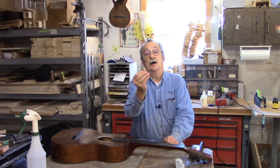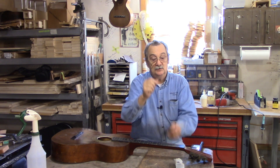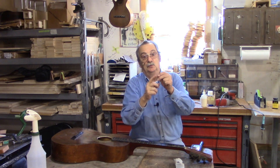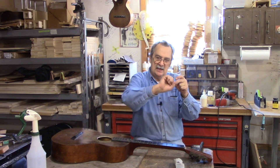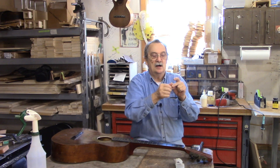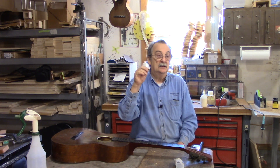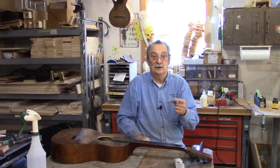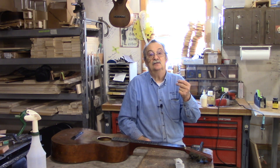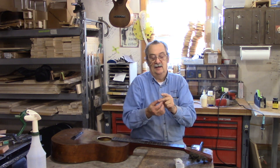One last thing — see that slot? That's not for a screwdriver; that goes in first. You want to put this in with a quarter-inch shoulder bolt. Run that in, kind of turn it sideways, go counterclockwise — that will free it and it will come out, and the insert will stick in there perfectly. It doesn't hurt to put a little bit of Titebond in there when you run it in — that helps to keep things from tearing out and will act as a filler, not so much as an adhesive.